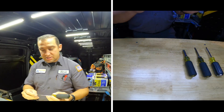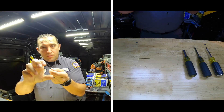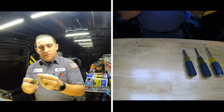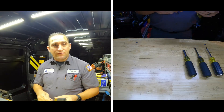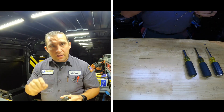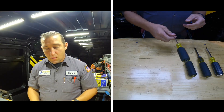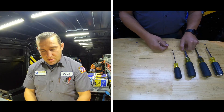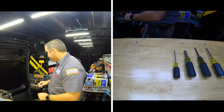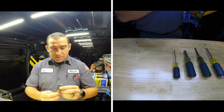This is a terminal block and DIN screwdriver — it has two different purposes. It works as a terminal block screwdriver for those little screw-style connections, but it also has a DIN connection tip where you can insert it to open up the DIN connector. I'll use this for insulated control signal wiring like 4-20mA signals. We don't work on live circuits — I might pull a 4-20mA signal off to hook a meter or test a valve, but nothing at 120 volts or 480 volts. Make sure the circuit is dead and locked out.